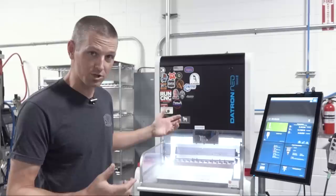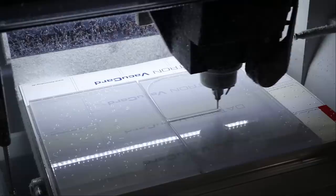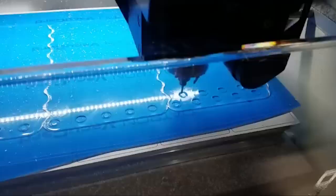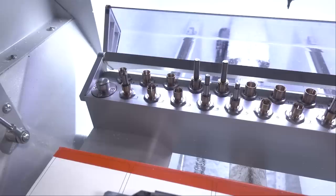2020 hasn't exactly panned out like anybody thought. So while yes we did a ton of Proven Cut work, we also — with Datron's blessing — were able to make a bunch of PPE equipment on the machine for hospitals and schools. That's actually one of the really cool takeaways that blows my mind about this machine. There is a film on the back of polycarbonate or Lexan, and we can regularly machine completely through quarter-inch Lexan and machine partway through the backside film. Absolutely awesome in terms of the capability, rigidity, and accuracy of these machines.